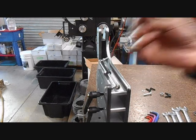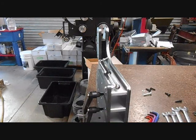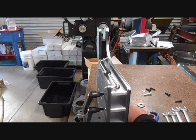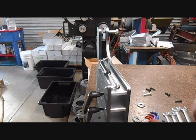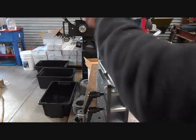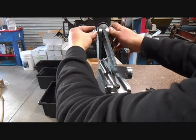There will be in the pack an M12x50 and an M12 nyloc, and also two acetyl spacers. The acetyl spacers are actually in the tension arm packet, so you'll need to get those out of the tension arm packet, and you'll need the tension arm. The tension arm goes this way up. Put the bolt through the hole, the spacer on, sit the tension arm in there, put the bolt through it so it should just sit there, then the second spacer, bolt through, and nut on the other side.